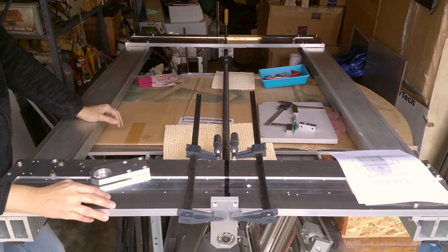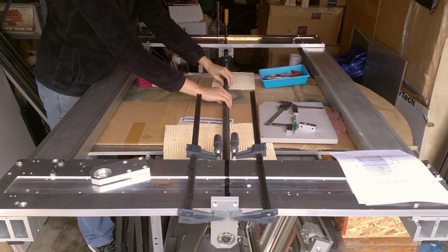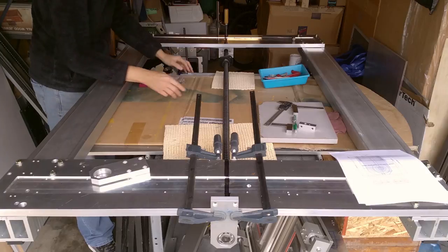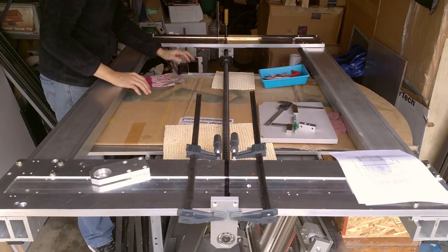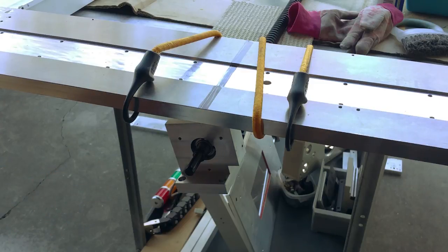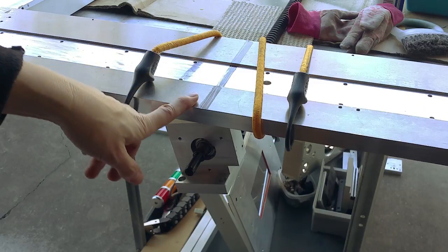The issue is that I couldn't mark the location for this block here until I made sure that the screw was pretty much tension free. I mean, it's going to bend a little bit under its own weight because you can bend this. And actually that's probably for the best, because otherwise it would bind hopelessly. And likewise, if you ran it close to either end, it would bind hopelessly. On the top here, you can see the silly light thing that I might throw somewhere on this thing. Who knows? I think it'd be fun. Anyway, I've measured also on this side and scribed a line down the center on top of some symmetric marker.